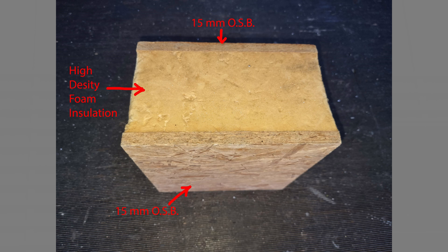Sometimes used in the USA are proprietary expansion bolts that penetrate through the top layer of OSB and open out into the insulation. Alternatively, a reliable way of attaching high loads to the surface of a SIP is to spread the load over a wide surface area of the OSB. A thick batten or board secured with multiple well-spaced wood screws provides a very secure foundation for any load-bearing anchor.